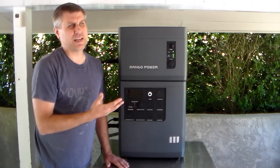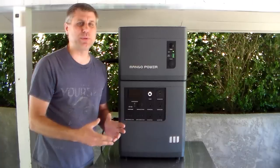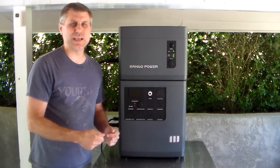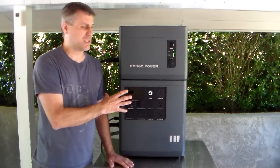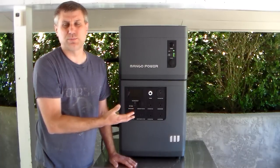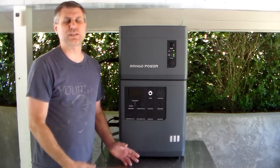Some people say, Dave, why can't I buy two or three smaller machines that have as much power as that? You can do that — that's an option. I like that option if I'm not using it every day. As you know, I move power boxes around because my shop in that metal building has no power in it yet, so I have to move machines around, and it is a pain every day checking them, bringing them back to the house, plugging them into grid power or solar. It's doable. The one advantage of having two or three smaller machines is if one breaks, you're not totally dead. If one part of this machine breaks, you're dead in the water. But if you have three machines that can do 2,000 watts, that's 6,000 watts — you don't quite max the seven, but you have that redundancy in case one breaks and you still have two more.